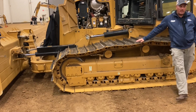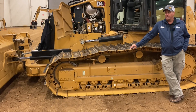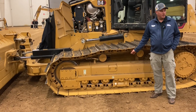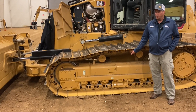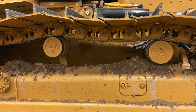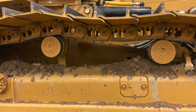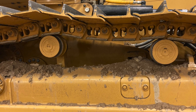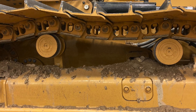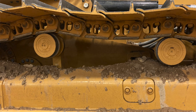If you've been around the last couple years with the D5, 6, and 7, you might have heard us talking about what we call Heavy Duty Extended Life Undercarriage — HDXL. That's one of the options on this tractor. HDXL has a little bit thicker bushing and a little bit thicker rail, and we've also done some work with that rail-to-pin interaction — there's a groove in the end of the pin and we swage material into that, basically locking the pin and link together. That's really important with wider tracks where you might start to walk those links off the pin.